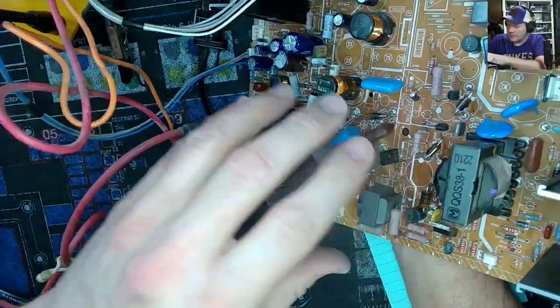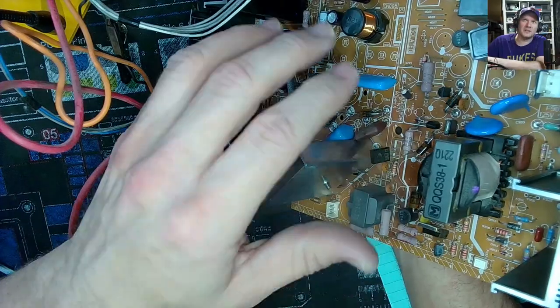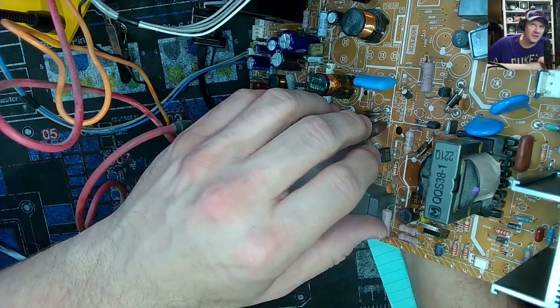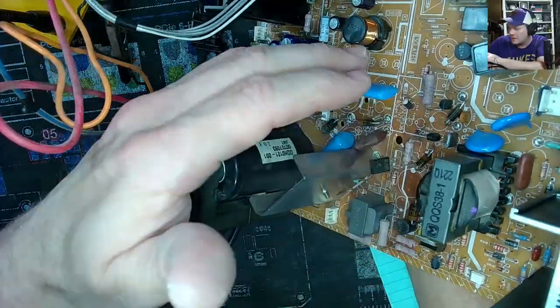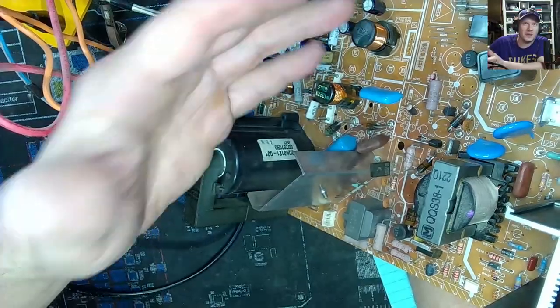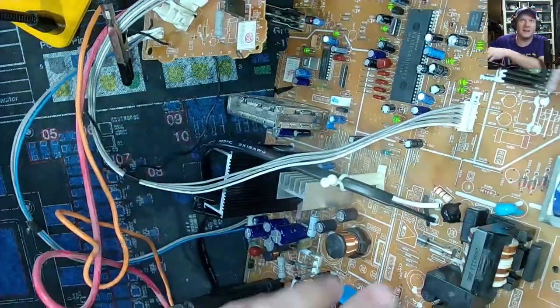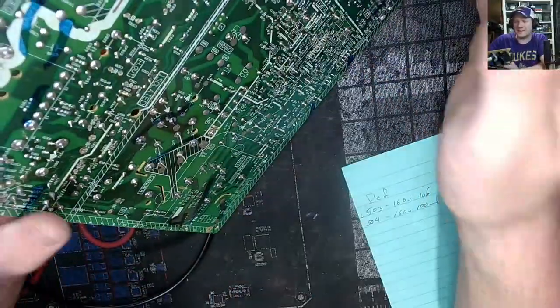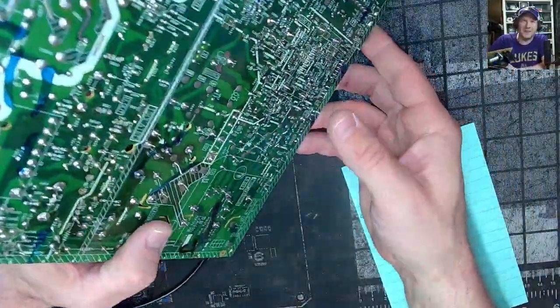Yeah, there's a bunch of things. And there's ones that actually have a built-in discharge mode, so you can just go through with ESR meters, that is. I have a bunch of ESR meters. So you can go through and just check the caps if you really want to. Even the ones on the other side. And if any of them have dried up, you could change it. But you've got to also remember, that stuff is not affecting mostly the stuff you're using.